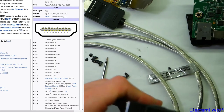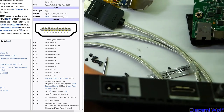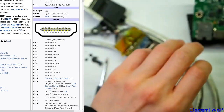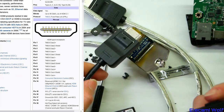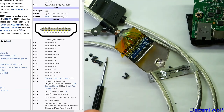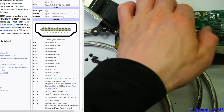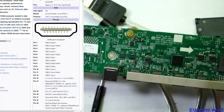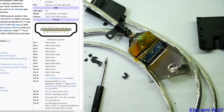I really want to solder an HDMI plug on there and see if we can view the output, but we won't be able to use this one — I don't have any 8K display, and the output will be permanently formatted for that specific panel's resolution. For the other One Connect box we might be able to try it, but we'd still have to have the TV plugged into the other end to actually turn the unit on. Hopefully that was an interesting look inside a fairly modern Samsung One Connect box with quite an intense power supply inside.